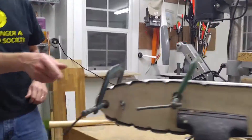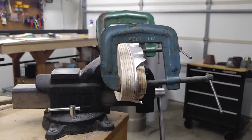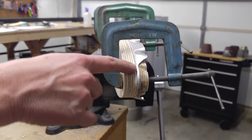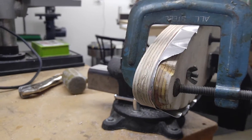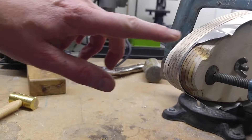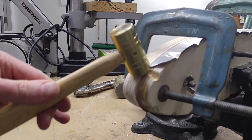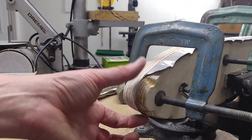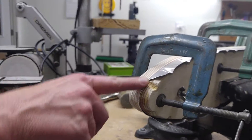If you want to come around here and look at the little radius on the front — this is what a lot of people have a lot of trouble with. This might be a little bit thinner; the plans call for a 5mm flange, this may be only about 4. But the real trick is to harden this wood with CA and use this little brass hammer. You kind of want to start working it as soon as you start doing the flange — don't wait until later or you'll get wrinkles right here, and it'll try to crack.